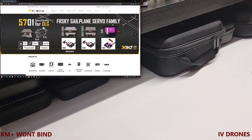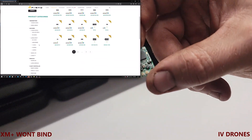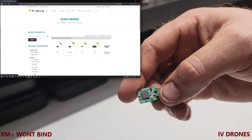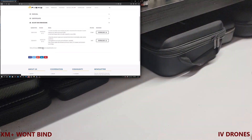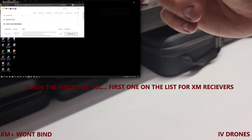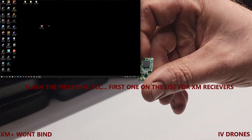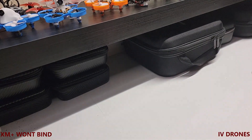So if that light starts flashing randomly, just backdate it. I'll show you where to access that firmware on FrSky's website. When you go into bind mode correctly, you hold the bind button and power it up — you'll get both green and red. When it's bound, it'll just sit red and green, and if you hit the button it'll blink green once or twice. That's the quick fix for units shipping with version 2.1.x. Leave a like, comment, subscribe if you have any questions.